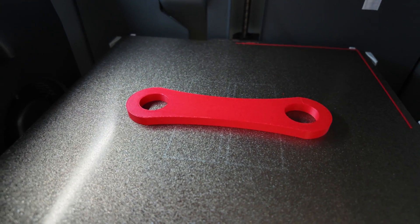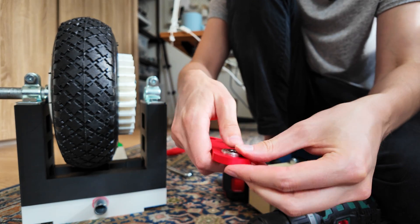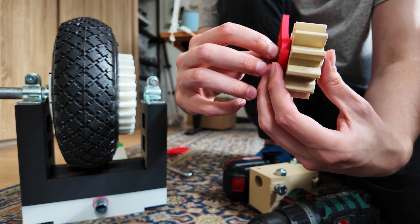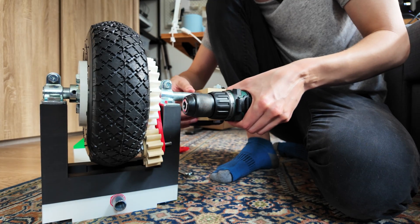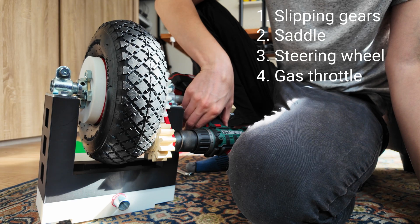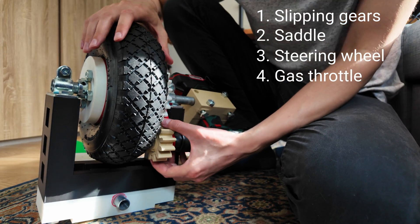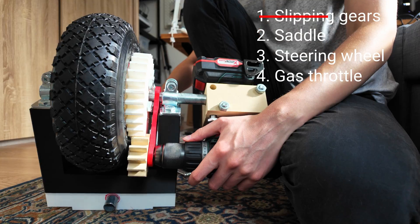Since the last part made everything crooked in the drive gears, I've made it slightly bigger. Here is our new part — let's hope this one does a better job. We can swap the old bracket for the new bracket, push the bearing in, and that's our assembly. Yeah, that's way better. I don't think there's any chance of these gears slipping anymore. Awesome!